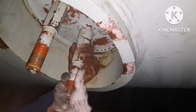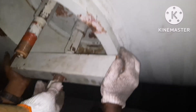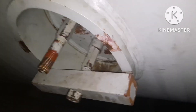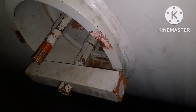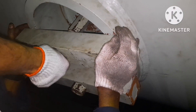Main air reservoir inspection is very simple. All you need to do is: drain the air bottle, check the foundation bolt tightness, check the guide bar tightness, and after completing your enclosed space permit, gas freeing, and proper ventilation of the tank, you can enter the main air reservoir. For inspection, always keep safety in mind. Both guide bars should be in place and the nuts should be kept tightened. This is how you do the inspection of the main air reservoir. I believe this video has given you some information about how to do a main air reservoir inspection on board ship. If you have any doubts, put a comment in the comment box or you can WhatsApp me — I will definitely reply. Thanks for watching. Thank you all. Keep supporting.